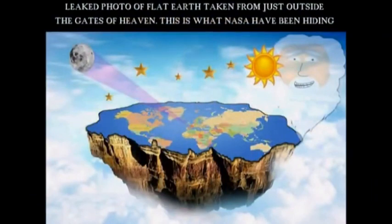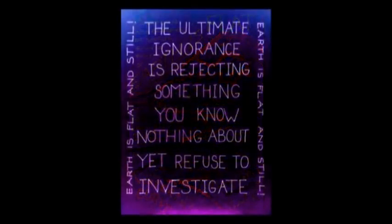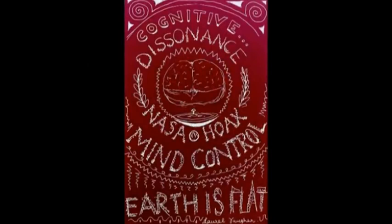Well, these little pumps are just a rough, low vacuum pump. These are nothing even remotely near what the vacuum of space is supposed to be. So you've got basically 5 different categories of vacuum, and one of them is rough or low vacuum, and that goes down to 1 torr. And then you've got a medium vacuum, which goes from 1 torr to 10 to the minus 3 torr. And so people go, oh, I'm in a perfect vacuum.